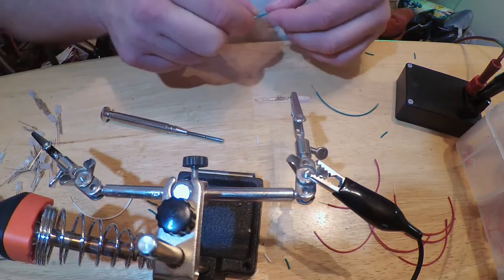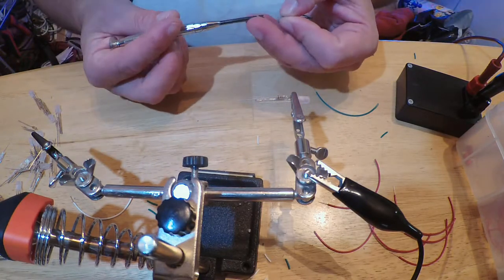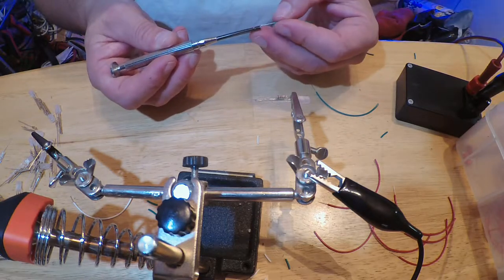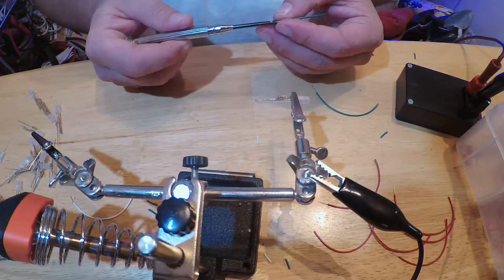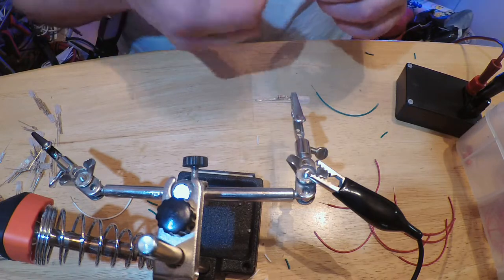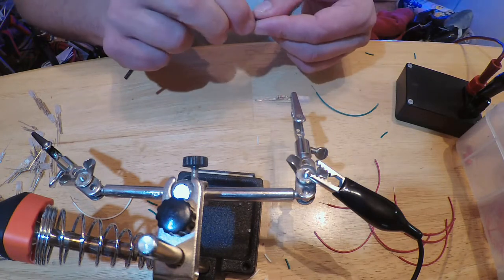Down. Now you're wondering why I'm putting the resistor on the common. Well, the reason for that is because if there's a short somewhere, the resistor is going to isolate the LED from the short, and that's the purpose of doing it that way. Also, the common is going out down the firing cable to the slot in the rail.